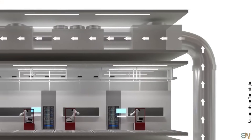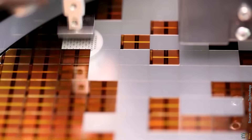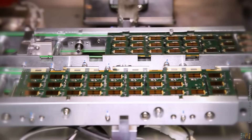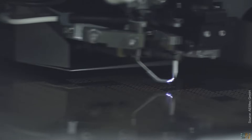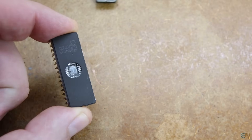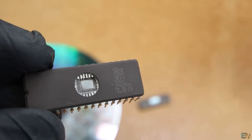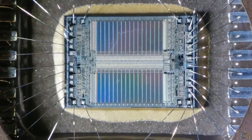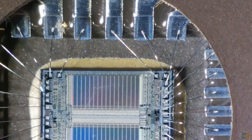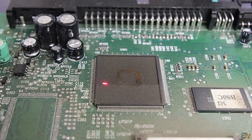The next step is to cut the chip to size, so the wafer is cut into all the separated chips. Then the chip is placed inside of an enclosure for easier use and protection. Using a very fine soldering tip, a small wire is soldered between the external pins and the chip connections. On this chip because it's exposed, we can see those metal connections. Let's take a closer look under the microscope — we can see how each pin is connected to the chip using very fine wires. Here I'm using my laser engraver to remove the epoxy on top and expose the chip inside.